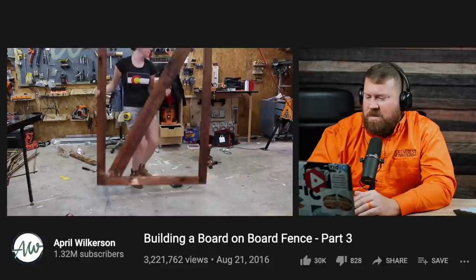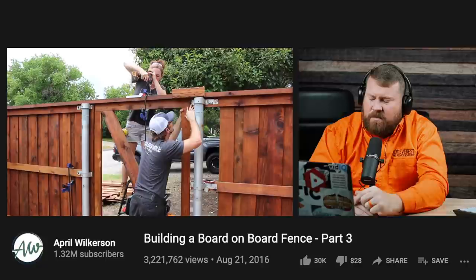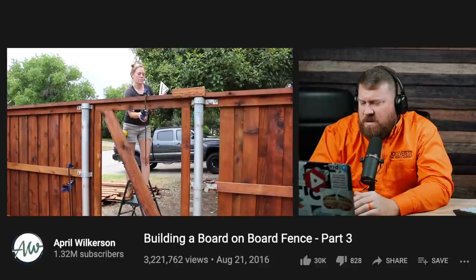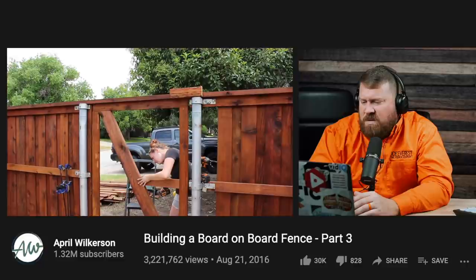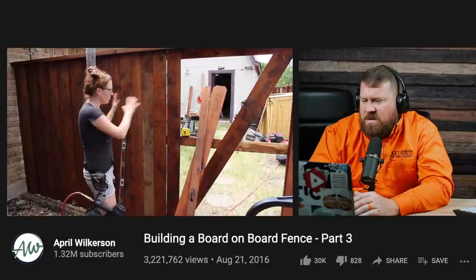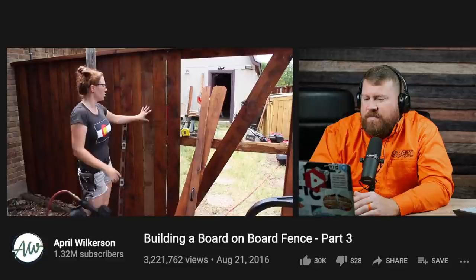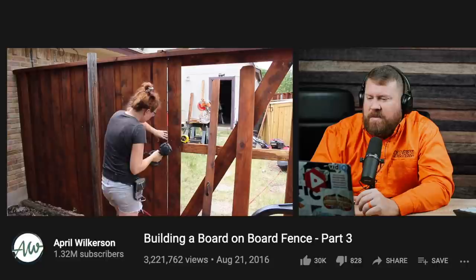April was only using a 2x6 for the diagonal because she ran out of 2x4s. To attach it to the frame, she used glue and three nails per side, pre-drilling to make it easier. She also left the top cap as one solid unit so she could attach the frame to the top cap without having to continuously wrestle with it. She added center horizontal members so that when attaching the hinges, there would be good material to go into. Then a small hiccup: it would have been smarter to start at the gate opening and work outward, rather than building up to the gate and then trying to fill it in, causing the pickets not to line up.